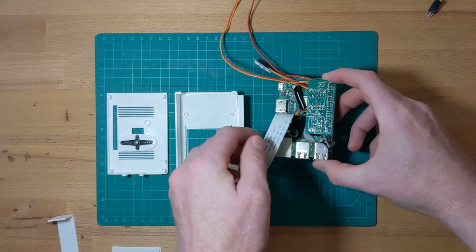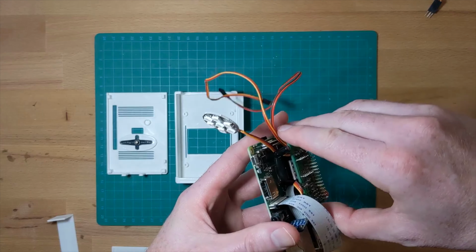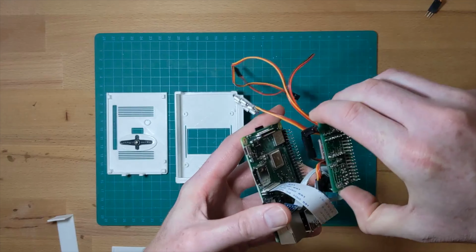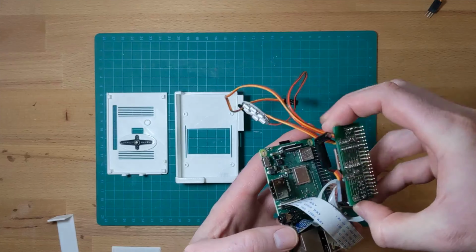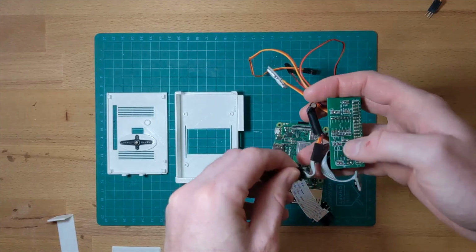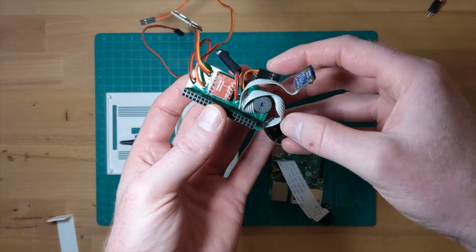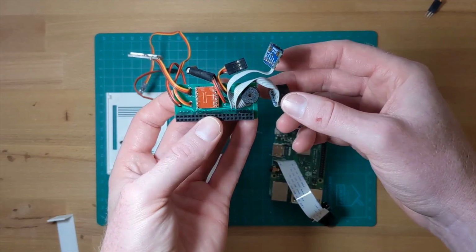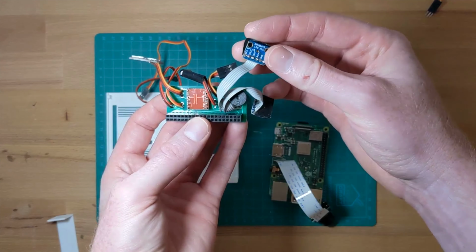This is the custom PCB that's attached to the Raspberry Pi. The header pins continue through the PCB so that any unused pins can be utilised in future. On the underside there's a buzzer for audio output and 2 MEMS microphones for audio input. There is an issue with the OS that's preventing audio input in the current version, but I'm looking to resolve that in future.